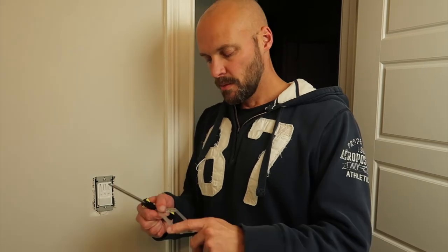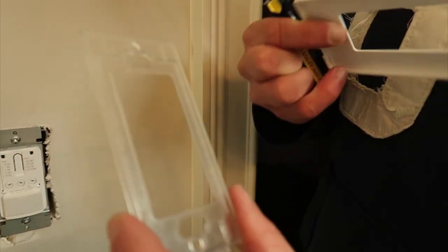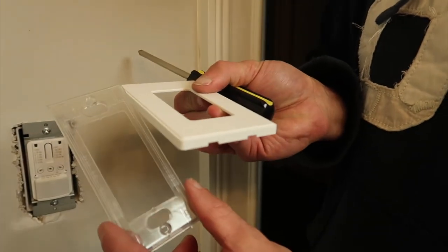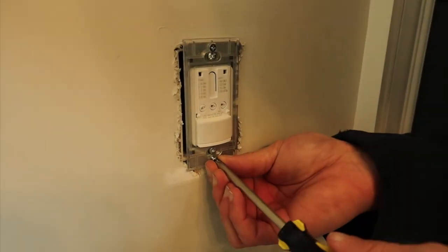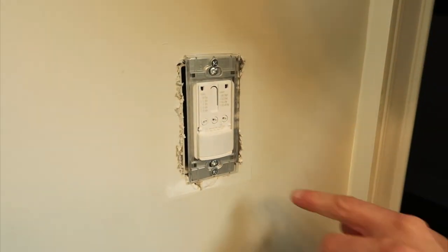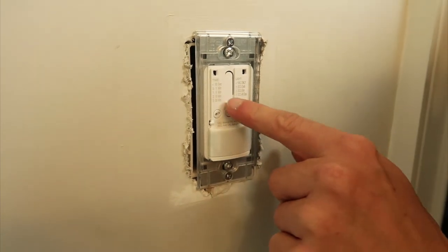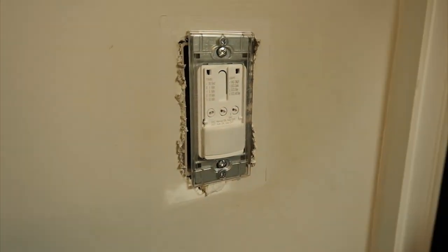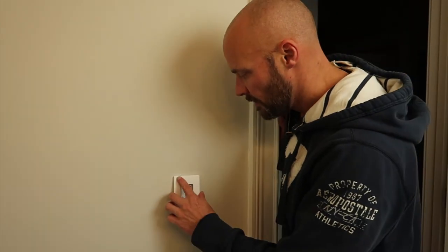With this particular brand, the light switch has no exposed screws, which makes it look more slick. You put the face plate in with 'this side out,' making sure the snap notch is on the bottom so nothing shows from the top. Then make sure all your settings are set — I want it on 30 seconds because I'm not giving them any more time. I put the sensor sensitivity all the way up and set it to full light. The dials turn easily but don't line up exactly where you expect, so be careful.